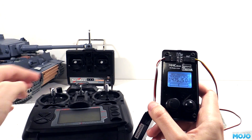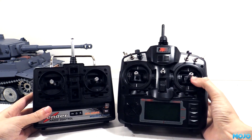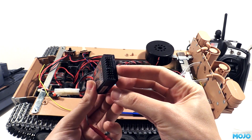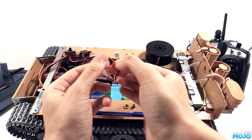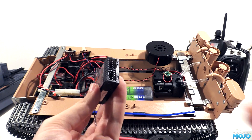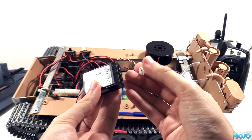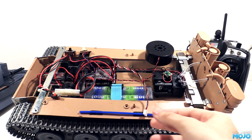Back to the Henglong stuff now, and our first job is to get rid of that creaky stock radio. This swap isn't quite plug and play. The Flysky radio has eight channel outputs, one per channel. The Henglong radio conversion only has three pins, so we need a widget that takes the eight separate channels and squirts out the serial data the RX-18 wants to see. There are a couple of boards available that will do the job, one from RC Tanks Australia for instance. But I've found someone that's written a nice little Arduino program that will do the job nicely — I'll link some information in the description.